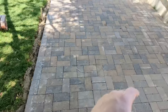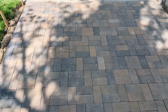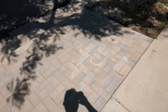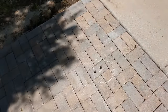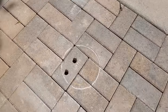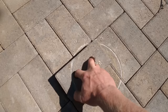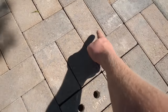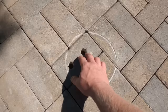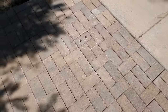But this whole edge is cemented along with that edge. Over this distance it should only expand maybe not even a quarter of an inch. Both sides of this are cemented. I ran into one issue - I have a water main, not for my house but for a good part of the neighborhood right there. So I marked where it was and it's under there and I will not cement it. I cemented these outside blocks in so they shouldn't move, then I'll leave sand out of this area so it'll still be possible to pull up if needed.